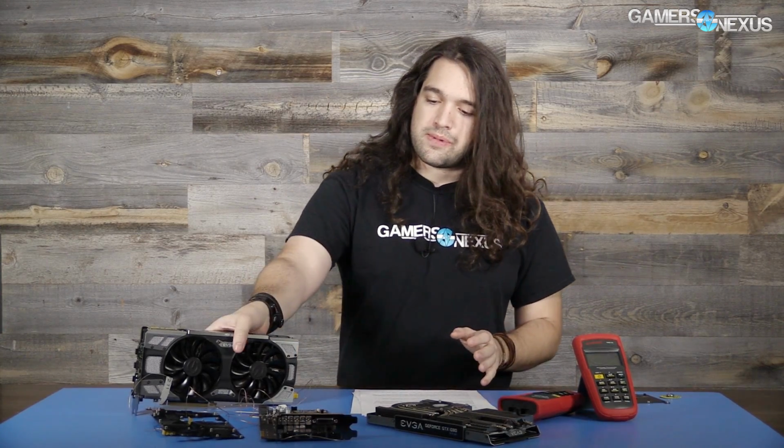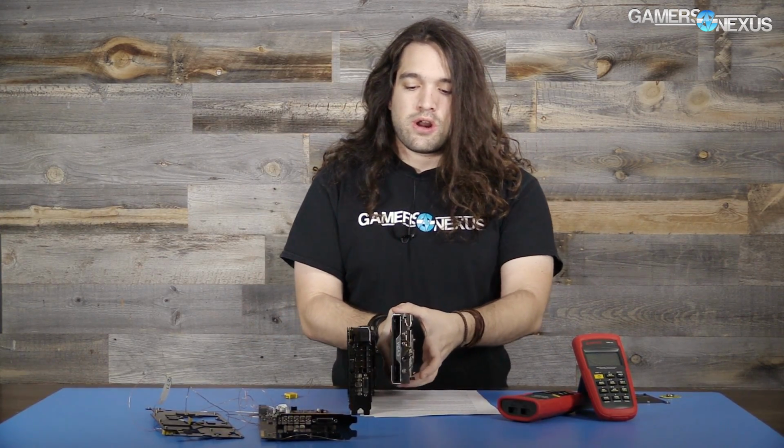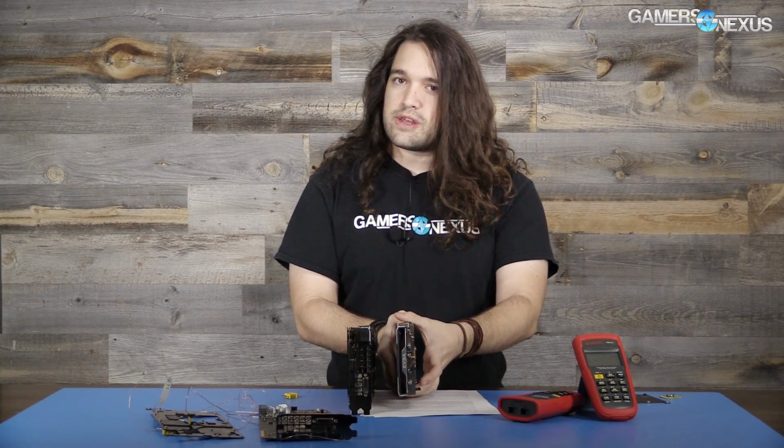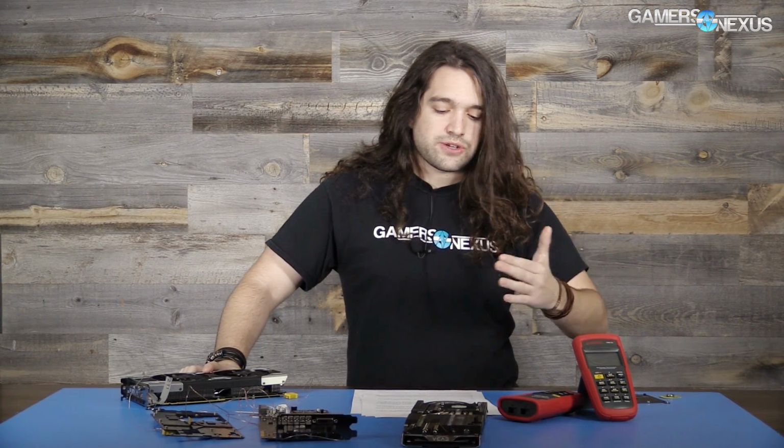Before the high ambient tests, and before applying the thermal pads and the VBIOS updates, the next goal is to test SLI 1080 FTWs with a 1-slot spacing between them. So that's basically the cards are not immediately adjacent, but they're somewhere around that far apart. It's maybe a good 1.5 or 2 inches depending on what motherboard you're using. This chart has some manual tuning in it because I was trying to figure out where's a worst-case scenario, so there were some changes going on live during the testing.